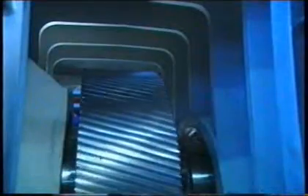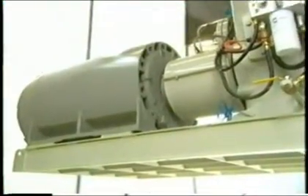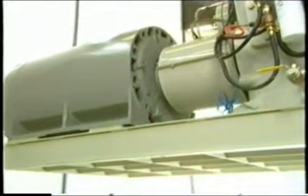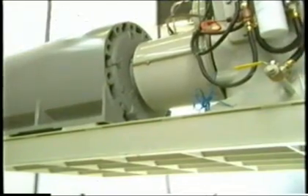The real durability of our machine comes from a cast gearbox with interior ribbing for strength and noise reduction. The gearbox is mounted onto a strong machine base onto which the driving motor is mounted, assuring accurate motor to pinion shaft alignment.